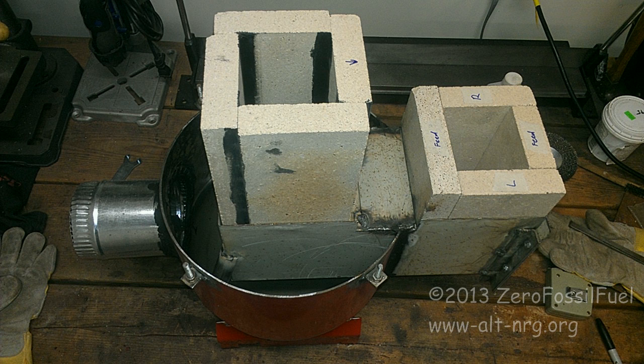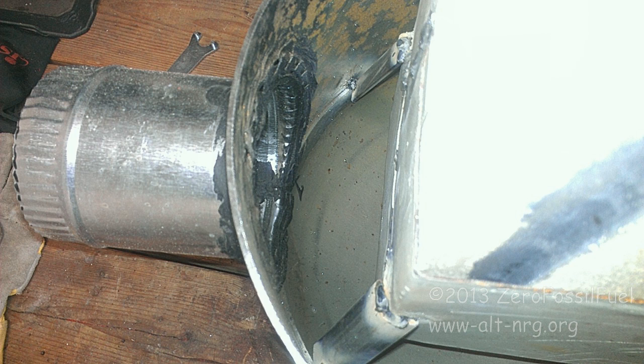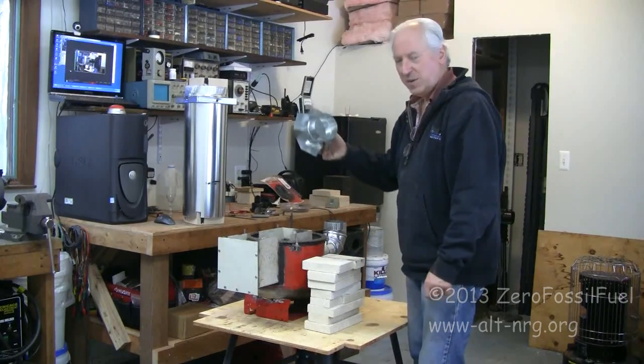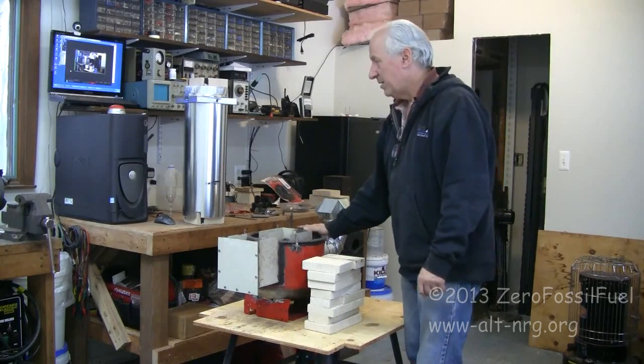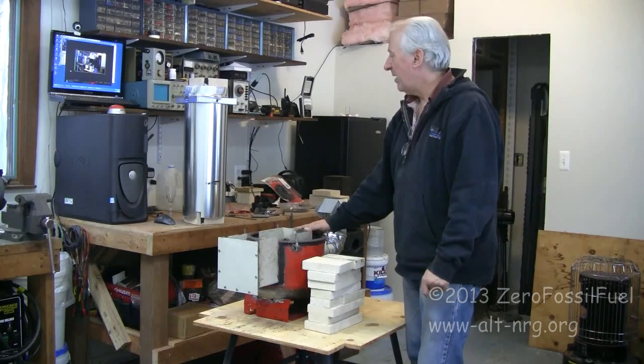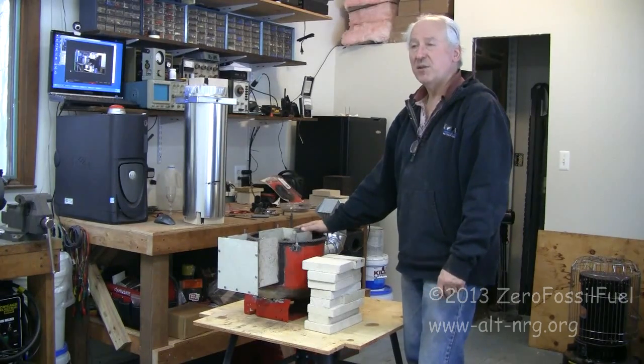In this next photo you see the inside of the rocket mass heater. You see that there are a couple of braces that have been welded to the back side of the firebox and tack welded to the bottom of the edge of the curved surface of the tank. You can also see in this photograph the four-inch galvanized pipe starter piece with the flared ends cut and folded outward and secured into place with furnace cement. On the back I have a 90-degree elbow and without my flue stack I have my chin cap as a joke, but I'm going to go through now how we go about putting together all of the bricks in the firebox and assembling the stack and putting the whole thing together. I will be testing this very, very shortly outside.